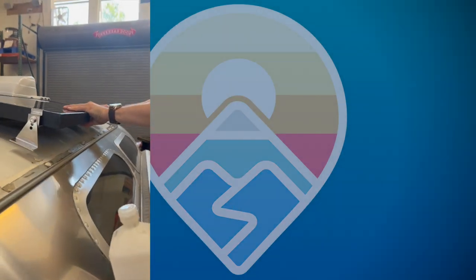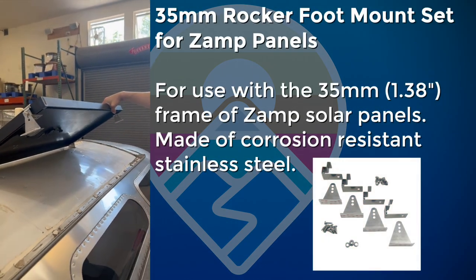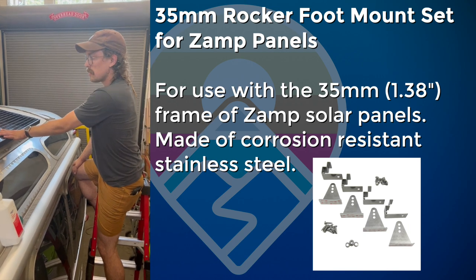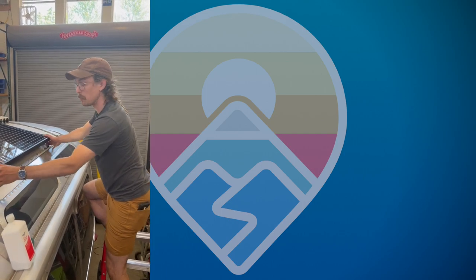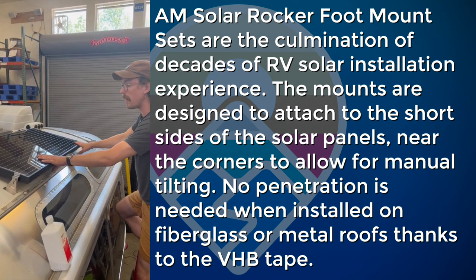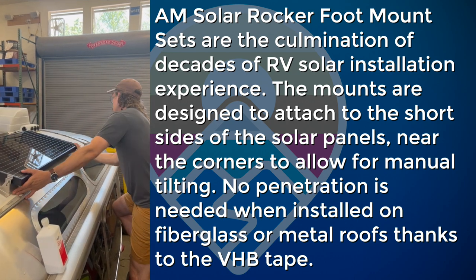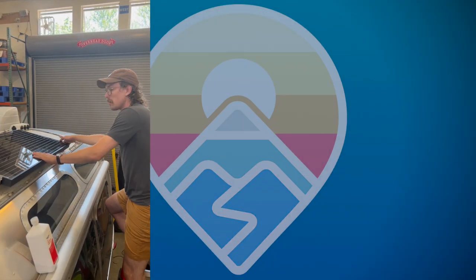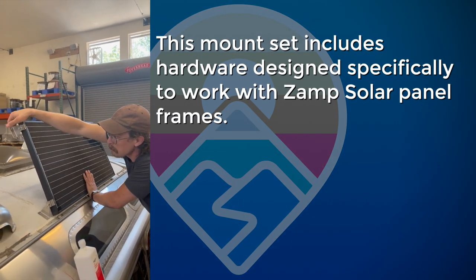The panel is on the roof but not yet stuck — the tabs are still on the back of the sticky feet so it can slide around freely. For lining up panels straight, you'll notice it more with more than one panel side by side, but you still want to make it as straight as possible. I leave the tape on so I can get it exactly where I want it, then put pressure on the back end where I want it to stay and lift up to peel the tape on the other side.